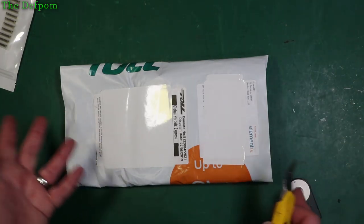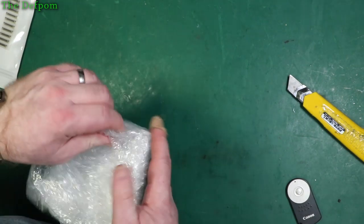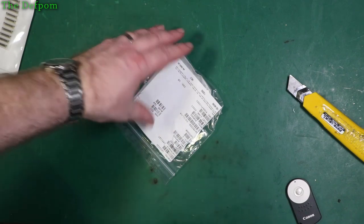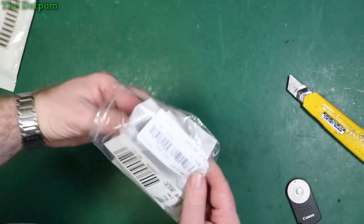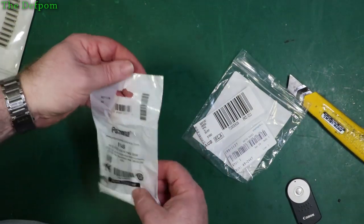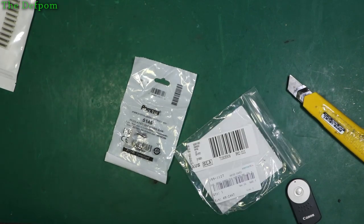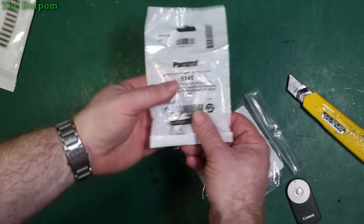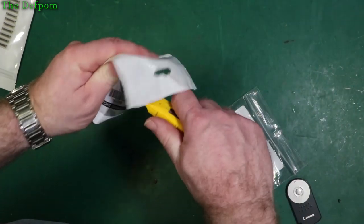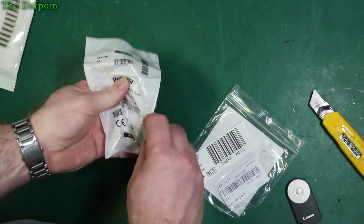It's an Element 14 bag. These are double banana plug shorting bars — just something a lot of people might be interested in. You can get this from Element 14, obviously. I've only got one in there — was one. I think I bought a few different things. So now it's Pomona 5145, a shorting bar. This is when you want to do a shorting link across the terminals of a device, or check for the short resistance, for example.